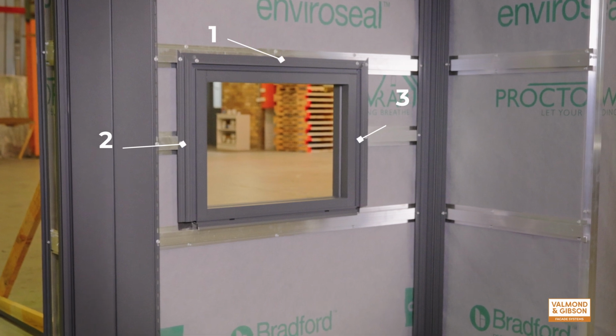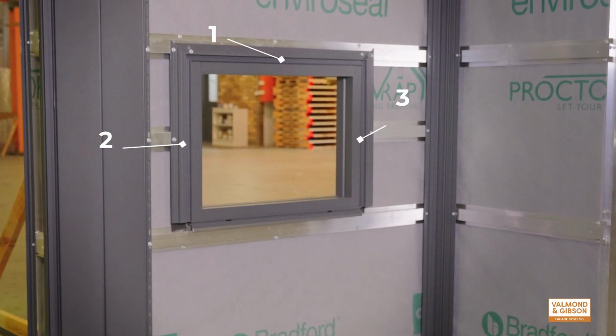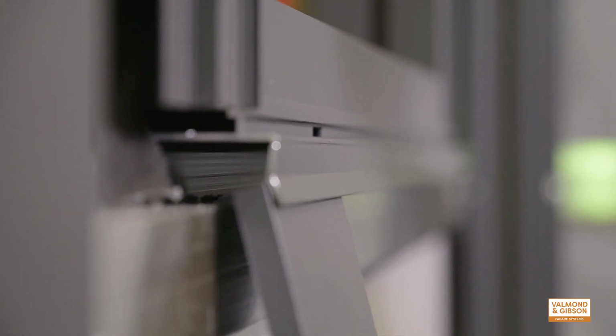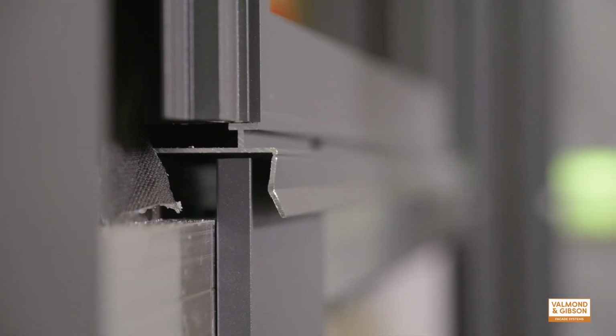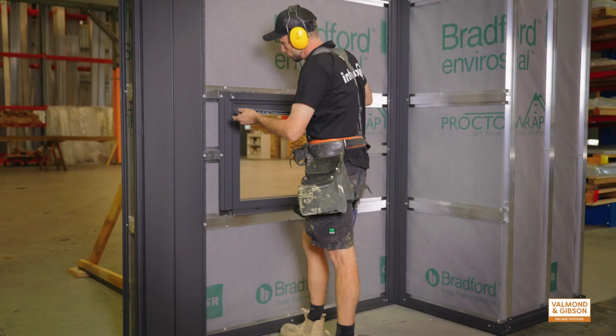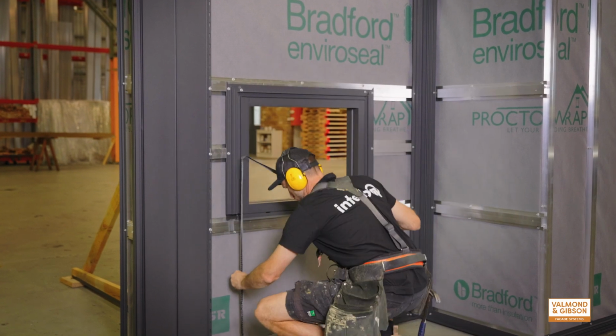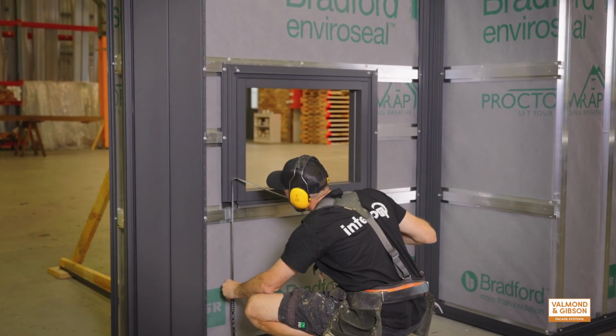The sill does not require a special trim to be installed. When installing the boards under the window, you will need to ensure that the cut cladding boards run all the way under your window frame sill. Now that the three sides of the window frame have the base trims installed, we can measure the cladding to fit around the window frame itself.